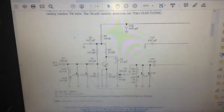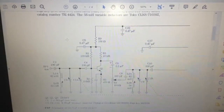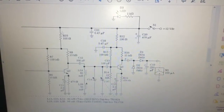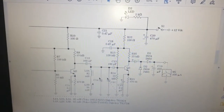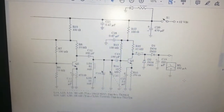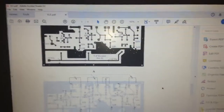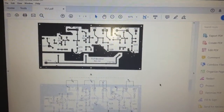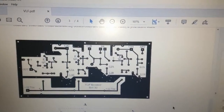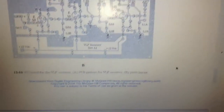The schematic is divided into two parts — this is the second part. You can see the gauge part with the 100 micro-amp meter. This is also the PCB layout, front and back. It's a very nice design and very good to print out. I will leave the PDF on the GitHub.